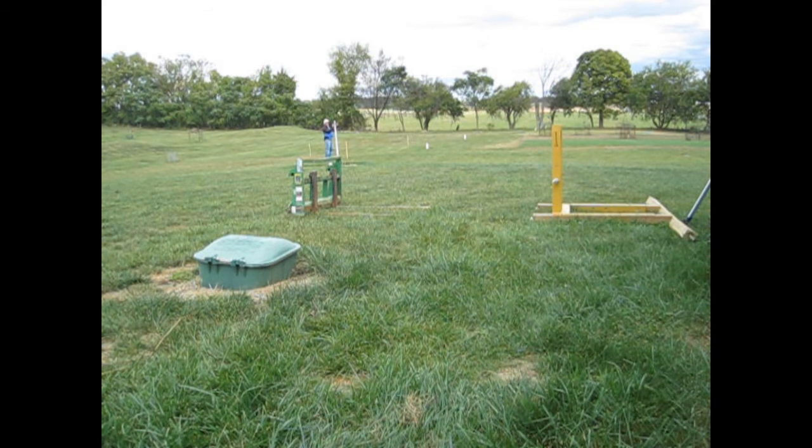Again, using the fast and slow beep, we can simply raise the measuring unit and then by hand raise and lower it to get an estimate of how far up and down we want to move the receiver so we can get it into the correct measuring range. Trial and error, we can accomplish this without a great deal of delay and do it all with one person.